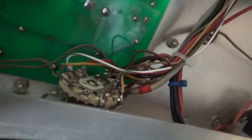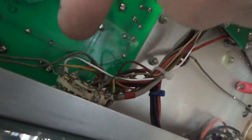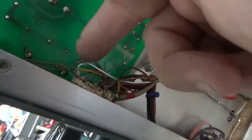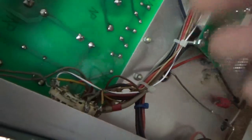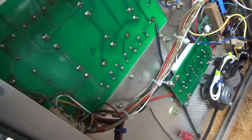Come to find out, the rotary switch in the front for the multimeter had carbon on top of the switch. So the grid wire and the one going back to the positive side of the meter were showing continuity — really weird. I was racking my head around it, comparing everything to another SB200 I have over here.